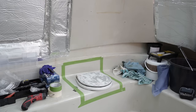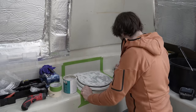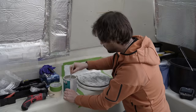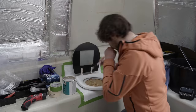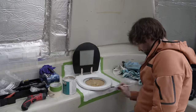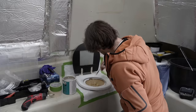A teammate of mine found the heads upper section, so I disinfected it and then sanded it back to a good key. The whole area around the heads needs to be easy to clean and differentiated from the rest of the gel coat, so I masked off a zone around it. Since there are all sorts of materials — filler, wood, plastic, and gel coat — I needed to do a pretty thorough priming job of the whole area with the Zinsser.